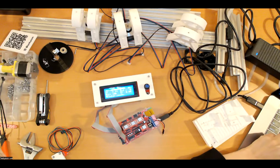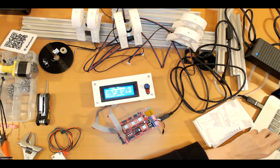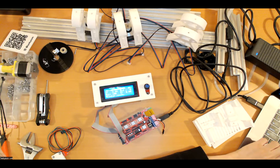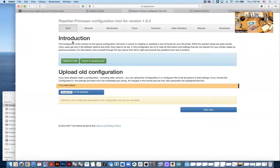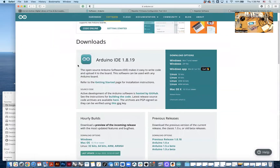First of all, I'll share my screen — I prepared the firmware. We're going to use Repetier firmware, and I will actually use Repetier Host to control the printer and also slice and control the printer. What you need is Arduino IDE; the latest version right now is 1.8.19. Download the version for your OS — I already downloaded the Mac OS version.